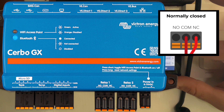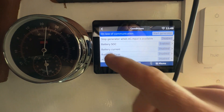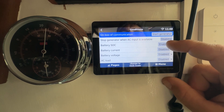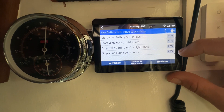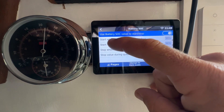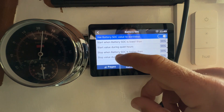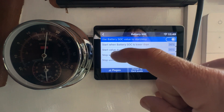Back in settings, above this there's Generator Start/Stop, then state is Running by State of Charge condition, set in Settings then Conditions. What I mean by inverse logic: on the back of the Cerbo GX you wire into Relay 1 using Normally Closed and Common. To use inverse logic, swap every 'start' with 'stop' and every 'stop' with 'start'. So on Loss of Communication, stop water heater. For Battery State of Charge enabled, I've got mine set at 98% and 96% - stop when battery is lower than 96%, start when battery state of charge is higher than 98%.